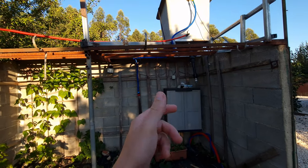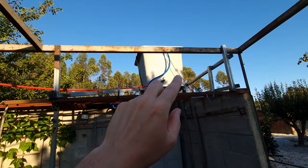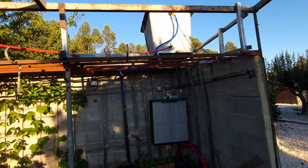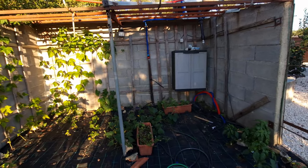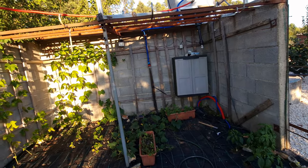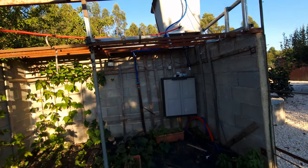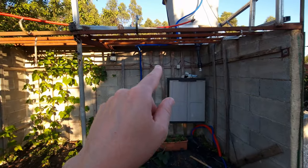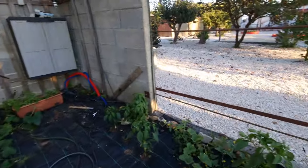Tomorrow we just have to cut this hose pipe, and then I'm going to show you guys how to switch this on electronically with the remote, and put it in the electro valve. Because when you suck the water with the water pump, what happens when it switches off is there's still a suction through the hose, like sucking through a straw in a juice box, and you just give it a push and then it just keeps on flowing. So if I open the tap right now, even though it's off, water will just keep on coming out, and then all the water goes from the tank. We don't want that. So I'm going to shut off the water within the electro valve and the water pump at the same time. So that will be cool. I'll show you guys how to hook that up tomorrow.